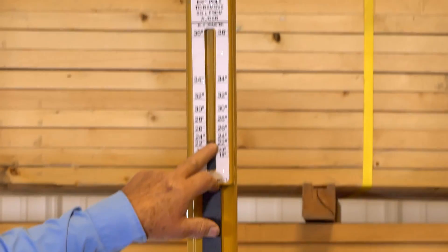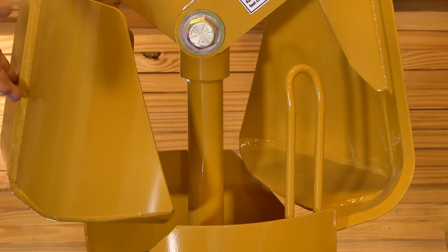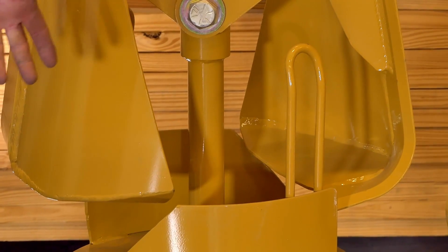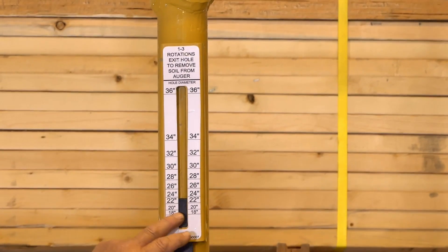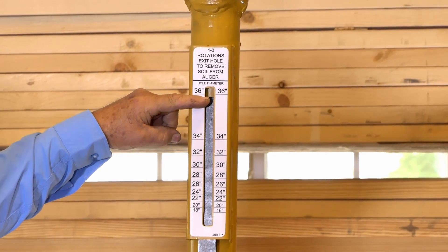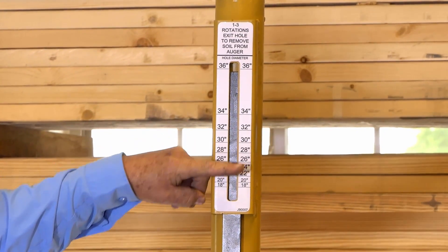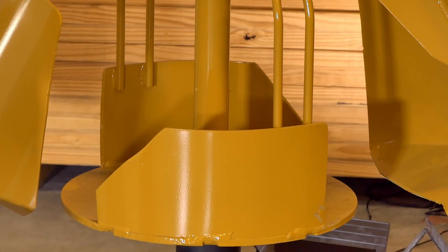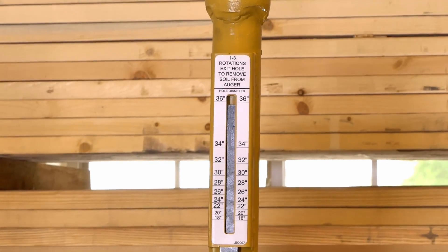This depth gauge right here is showing 22 to 24 inches. When you pick this out, these blades you can see are a little bit past the base, so when you pick it up that gauge will clear down to 18 inches. Right now with it in the lock position they flare out a little bit — that's just a transport pin. This one is all the way maxed out. The gauge is clear up here to 36, which tells you you've reached maximum width. This would be two inches short of maximum width at 32, 30, 28. So the wider the hole gets, the farther the blades come out and the higher this will get. If you just need a 24-inch hole, go in and make a couple of cuts and come back out and you've got your hole to the width you need.